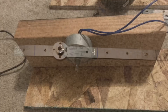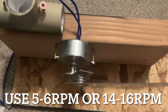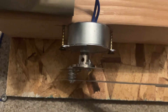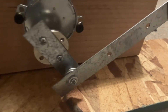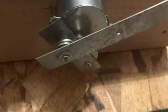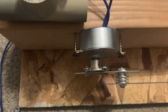Here's how I put the synchronous motor onto the OSB board. I have a hinge where the shovel is going to go, and if you look at how I have the initial bracket on the synchronous motor, I have it hooked up with a bunch of washers to give it the space it needs to rotate with that arm. You can see I have washers in between because it needs to clear as it's turning around. I probably could have done less, but that was enough for me.